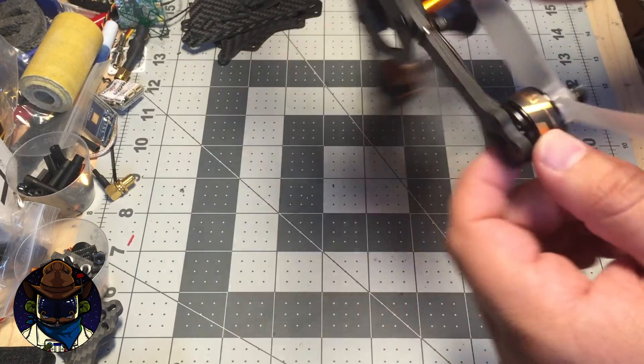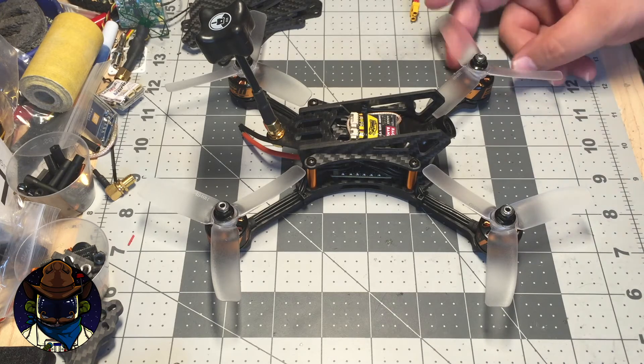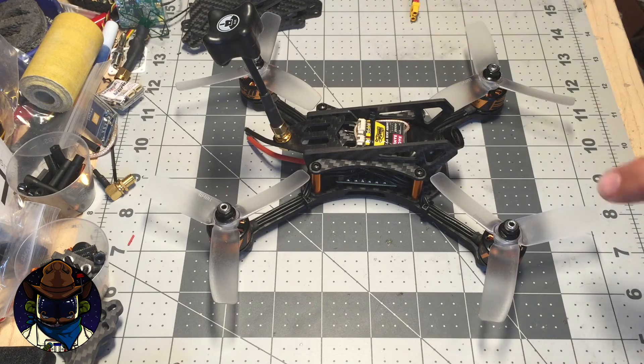That's a nice feature because traditionally these motors have tended to be weak — you hit the bell on anything and you bend the shaft. I had a tweaker with 1806 T-Motors that had a 2mm shaft, and that was the worst part: any time I hit the props on something I'd bend a shaft and it was always a pain to replace. These are a lot nicer with a much stronger shaft, and I'm not sure if any other motors in this size range have a 3mm shaft.